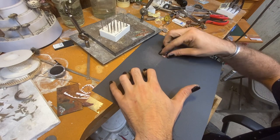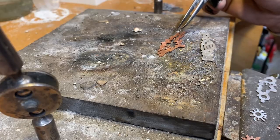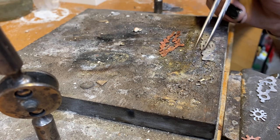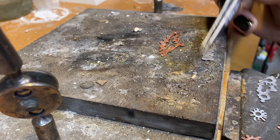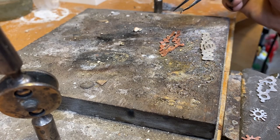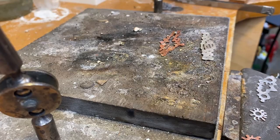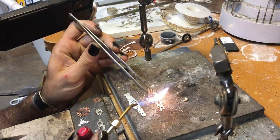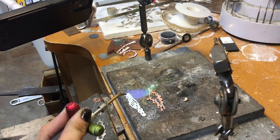And there's lots and lots of sanding! Now on all these layers, I'm gonna use hard solder. You wanna get a nice placement, spread them out. Make sure you get enough places where it's gonna contact the next piece, depending on what your design is. This is called sweat soldering if you ever need to look up a technique on this. For this whole project, all the solder I'm gonna be using is sweat solder. We get the metal heated up, watch the solder ball up, turn into a little mound, and then into a little puddle. Usually if you heat it up too fast, your flux or boric acid and alcohol is gonna bubble up and it'll make your solder chips jump off your project.